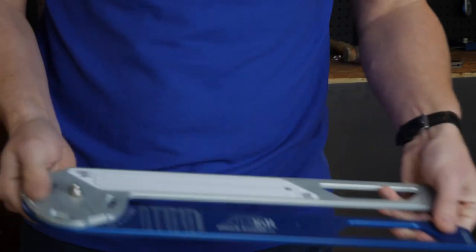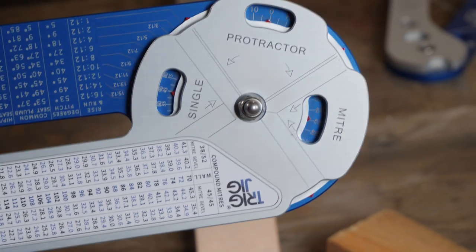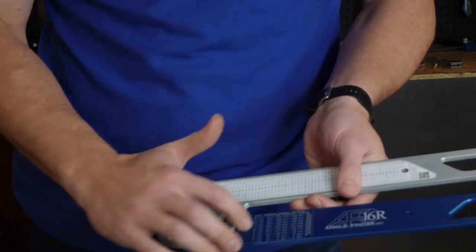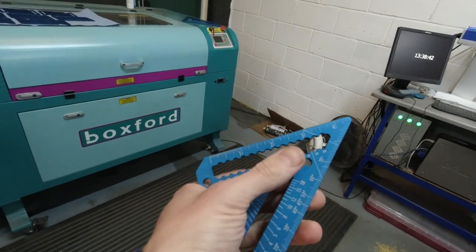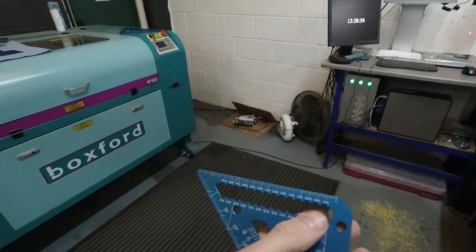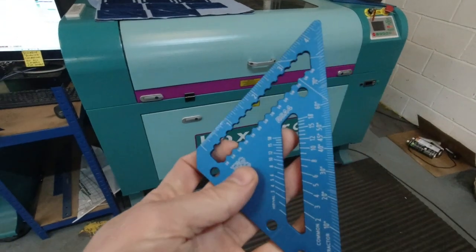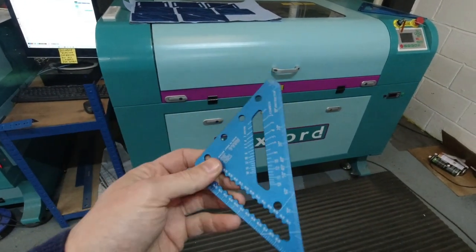One of the really nice things about this is it's fully CNC machined. We've got a bunch of different dials — the protractor, the mitre, a quick-lookup compound mitres table used for coving or crown moulding, and roofing pitches for rafter cuts measured as rise and run or degrees. In the spirit of efficiency, we're also lasering some RSA-4s, which is the new product we're bringing out. You can see we've got the inch measurement system on these, with every eighth and sixteenth on the back. Fences are stepped so you can rotate them to get different measurements. Just like the rafter squares, we've got notches rather than scribe holes. We've got the protractor running up one side and the common and hip-valley — just a handy little tool, very light. I'll update you with these RSA-4s and the metric equivalent, which is the RSA-100.